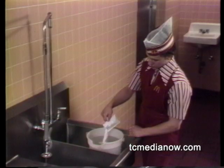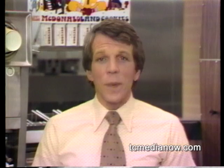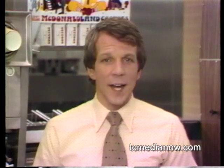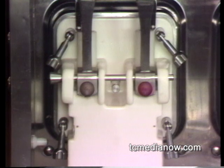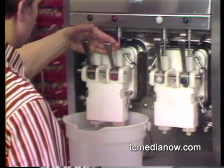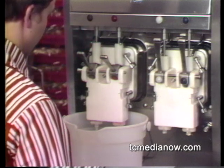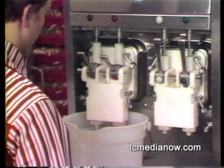Now mix a bucket of sanitizer detergent solution. Next, repeat the entire wash cycle, this time using two gallons of the sanitizing solution. But remember, don't open the draw valves until sanitizing solution starts to flow from the torque rotor shaft bleed ports. When it does, open the draw valves and allow the sanitizing solution to drain. Repeat the same procedures for the other chamber.